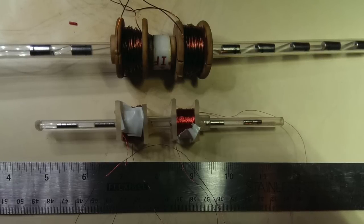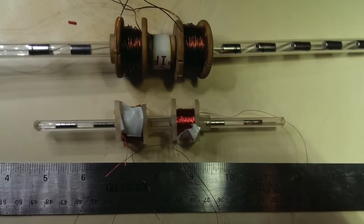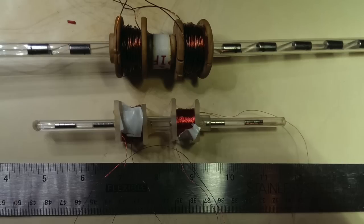In addition to the one-quarter inch diameter magnet size, I have also built some working prototypes using one-eighth inch magnets. One possible advantage of the current linear motor approach is that it may be possible to make smaller actuators than can be made using rotary motors and lead screws at low cost. Even a very small, weak machine made from small gluss pushers would make a fun development platform so long as it was strong enough to move itself into programmable positions. Imagine a gluss composed of 200 members, each a mere two inches long, that could sit on your desktop and quickly assume a menagerie of shapes.